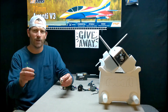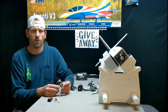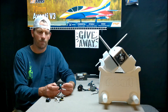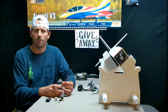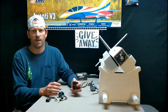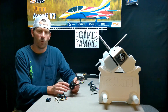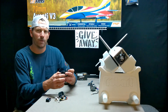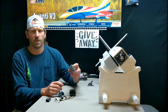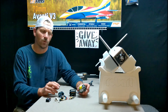This brushed motor is from the Radian — really small. I've got a 9-volt battery here for size comparison. This brushless motor came out of a UMX Turbo Timber — this is what they call a size 10 motor, it comes in many different KVs. You can find this motor in the Timber and the Air Tractor. This one came out of the FMS Pitts or the Beaver — it's a 4258 with a 550KV, meaning 42mm wide and 58mm tall.